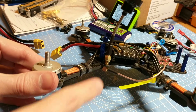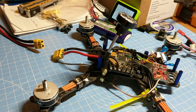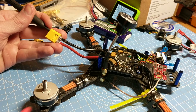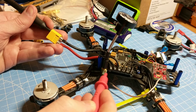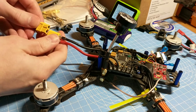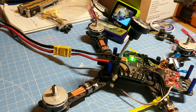So all we've done is put that right-angle SMA connector through the carbon, which means that now there is continuity between ground — I'll take it off the XT60 so you know I'm doing it right. There is now continuity between ground and the carbon, because it's getting it from the SMA. If I plug the power back in and bring the throttle up, you'll see that now I get really bad interference on the FPV feed.